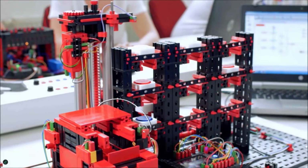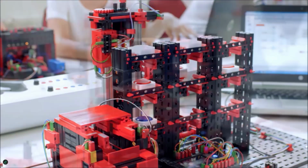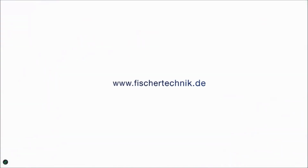Dimensions for this model are approximately 19 by 28.5 by 15 inches, and it has a total weight of 18 pounds. Again, the 24-volt version has a relay board for motor polarity reversal, and the multi-pin connector, 34 pins with a grid of 2.54 millimeters, as well as the additional PCB terminals with push-in connections for all inputs and outputs. Again, you supply the PLC and the programming. There is also a 9-volt version available, and you will need the power adapter for that.